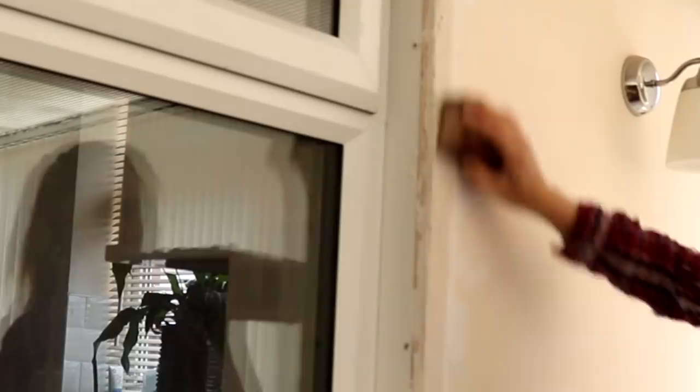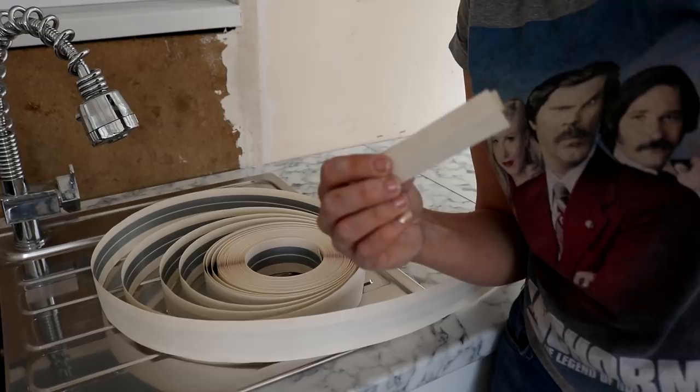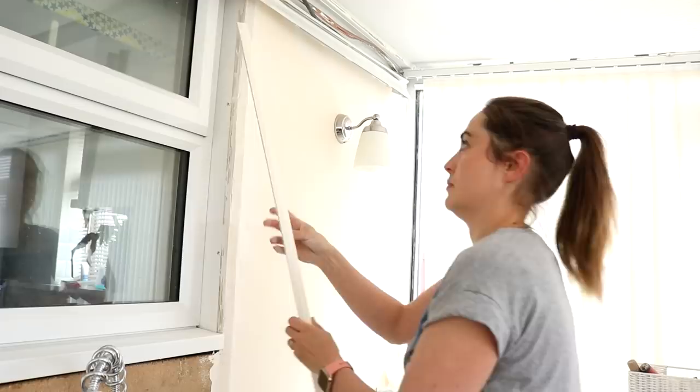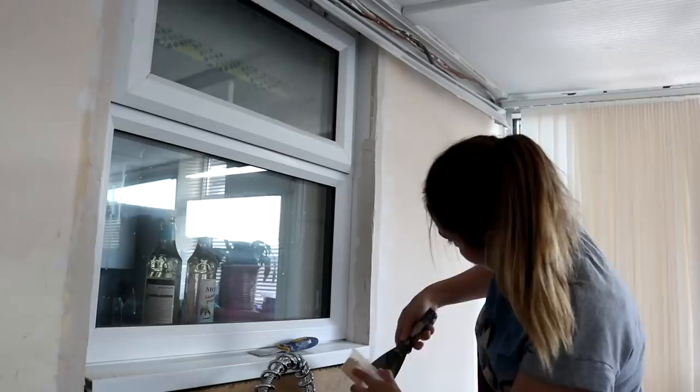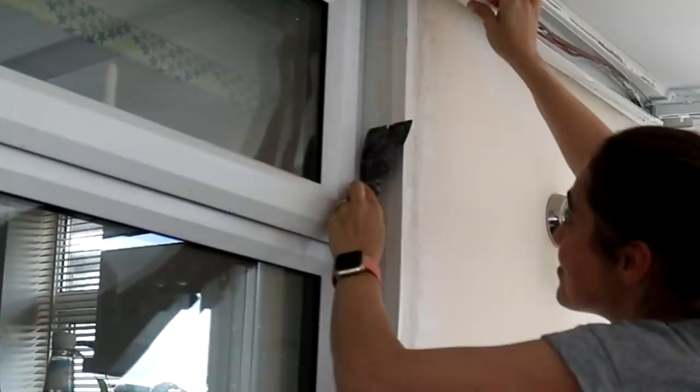Something my father-in-law recommended was to use some corner tape. Measuring the length I needed — it's two metal strips attached to some paper and it folds exactly in half. I'm cutting it down with very sharp scissors, otherwise you'll need tin snippers. I folded it and held it against the corner to see if it fit — I rather like this invention. Once I knew it fit, I removed it, brushed over the area with more PVA solution and left it to dry. Then going over it with some more filler, followed by adding the corner tape back again. I pressed down either side with a filling knife, going downwards, squeezing as much filler out as I could while trapping it into place, and then repeated the same for the opposite side.